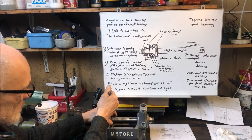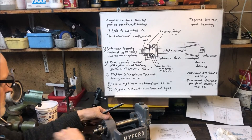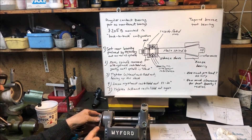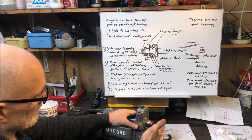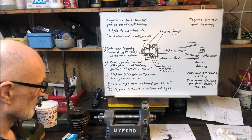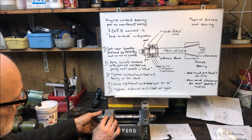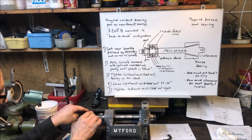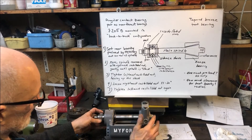Slack off 15 to 20 degrees — then you should be able to feel that it's free. Tighten this nut. You can then measure the radial clearance up and down, which should also be about 2 to 5 hundredths of a millimeter. So: static rear bearing, preload set by the inner ring, snug on the outer ring, then moving the whole assembly to the left — by this, setting this clearance — you have the correct running spindle.